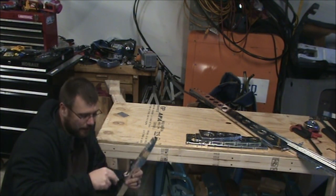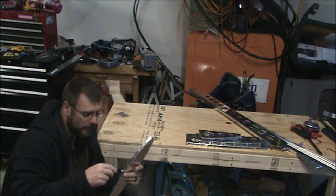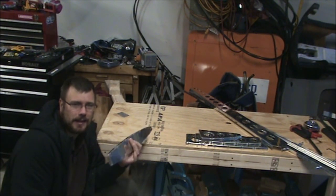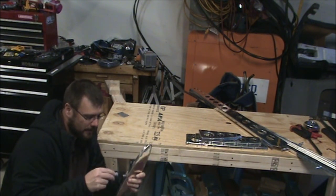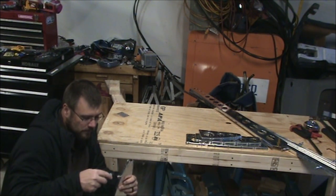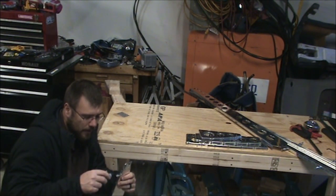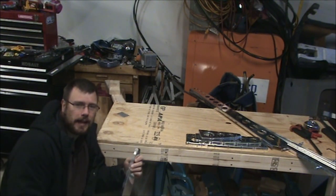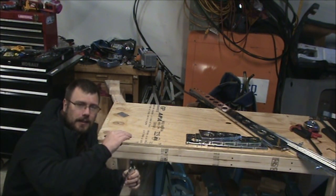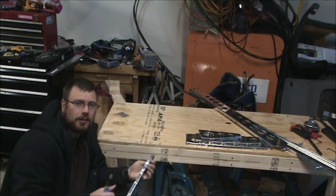So if you think about it from an engineering standpoint, wings of an airplane are nothing more than giant cantilever beams that have a constant load across them for lift, but then I also sometimes see point loads in specific spots depending on what's going on. And then a lot of the twisting forces that you would get is actually spread around by the skin between several components. And it's the actual aircraft skin that is providing you a good deal of the aircraft's rigidity and structure.